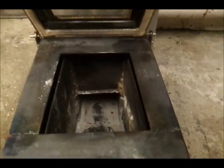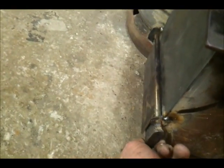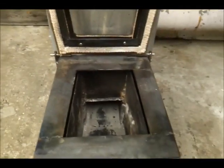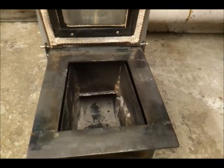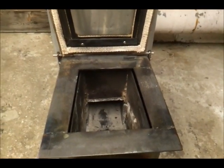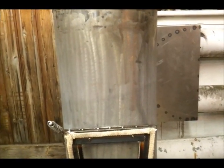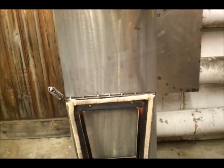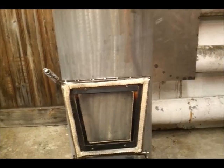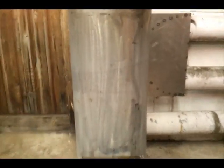I'm really surprised how incredibly clean the glass stays - it does get a bit sooty when burning low, but other than that it's fantastic, works really well. With these little vents on the side I can control the burn of the stove. That box is about five litres in volume and with a controlled burn I can get four hours burning out of that much timber, which really surprised me. The workshop is very warm - even burning it slow you cannot touch that bottle, it would take the skin off your hands.